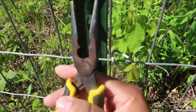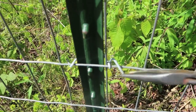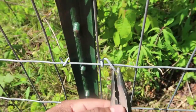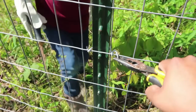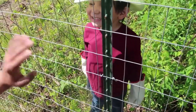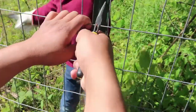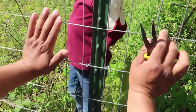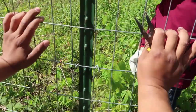To be a little more secure, I grab my needle nose pliers, pull it down on this side and pull it back. It does take a little extra time, but for the safety of the goats it's worth it — I just like to bend it back. Goats get up against the fence, scratch their backs, and you want to make sure they're safe. Also, put the fence on the front side of the t-post so any animal pushing against it hits the post, not just the clips.